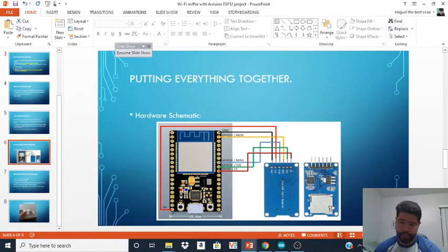All right. Now, the good thing about this micro SD card that you see right here, if you get this exact same one, is that it has a voltage regulator. Usually the micro SD cards can't handle more than 3.3 volts, otherwise you're gonna fry the circuit and it won't be functional. So make sure you be careful, and if you get one of these, you won't have to worry about it. So yeah, that's pretty much it, and this is how you connect them. Make sure you follow it thoroughly and you should be ready to go.